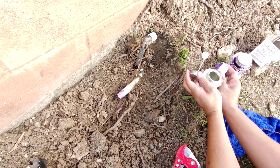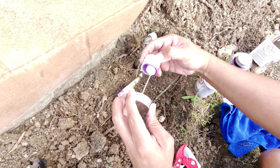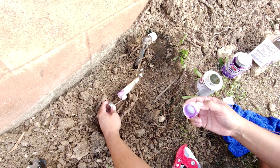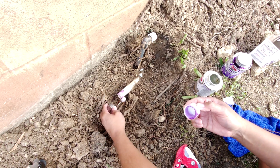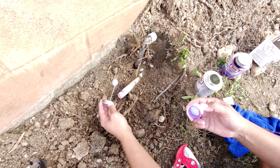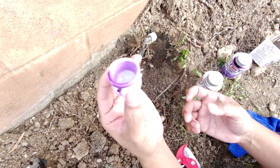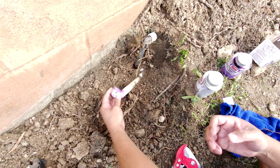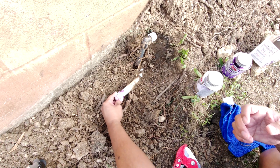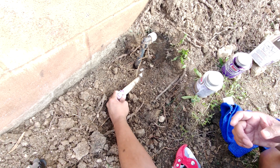The next step is putting in the glue. I'm going to put the glue inside the cap and also right around the pipe end. Then what you want to do is push the cap in and twist it at least a quarter turn — push it in and twist it to make sure that all the bubbles are removed.